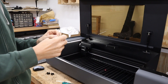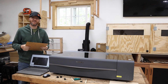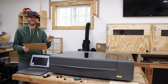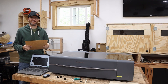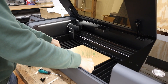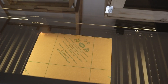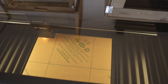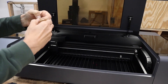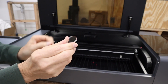I don't know if engraving toothpicks is really practical, but it just kind of shows the fine detail you can do with this machine. The last thing we're going to test in this video is cutting clear acrylic. This is one of the main reasons I wanted the CO2 laser compared to the diode laser — diode lasers can do colored acrylic but cannot do clear acrylic. There you have it: clear acrylic cut perfectly.